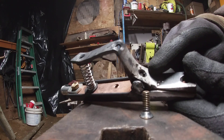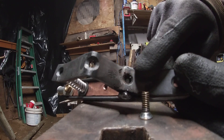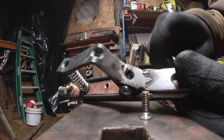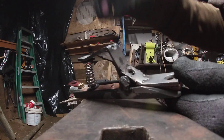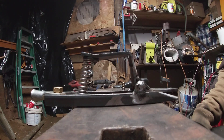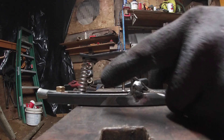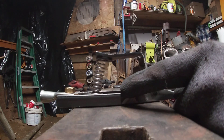The top piece is another L-bracket. I insulated the quarter-20 all-thread inside — there's a piece of rubber wrapped around it. You don't want to be opening and closing it and having it sparking on you. It shouldn't be sparking unless you're getting both positive and negative connected, so like when you go to strike your electrode you don't want that sparking. Same with the spring — you don't want that uninsulated.